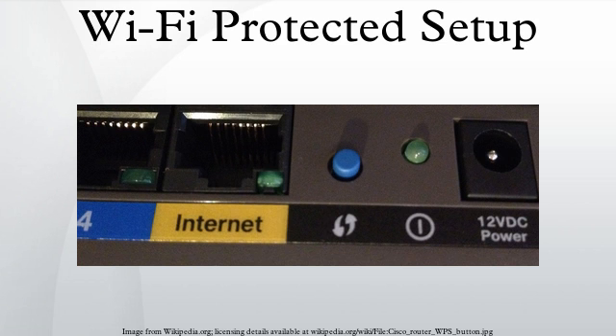The last two modes are usually referred to as out-of-band methods, as there is a transfer of information by a channel other than the Wi-Fi channel itself. Only the first two modes are currently covered by the Wi-Fi Protected Setup certification. The USB method has been deprecated and is not part of the Alliance's certification testing. A few wireless access points have a dual-function Wi-Fi Protected Setup button; pressing this button for too long can initiate a factory reset of the wireless access point.